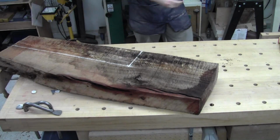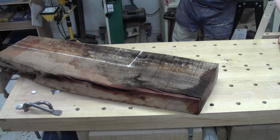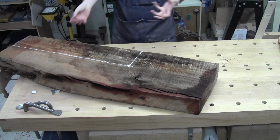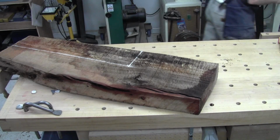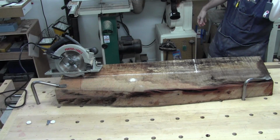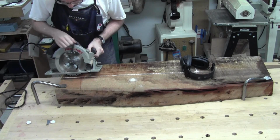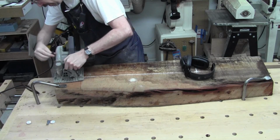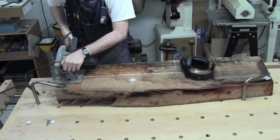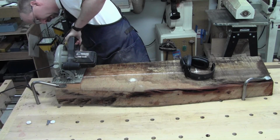So I'm going to take my circular saw, I think, and just cut as deep as it'll go in a couple of passes and try to free this chunk of board. The rest of it I'll make pieces of because I don't need anything long after that. We'll see how this does. This is going to be noisy and messy, so I'm going to set my blade, my cut depth, to about a 1/2 inch or less. Gotta open it first.